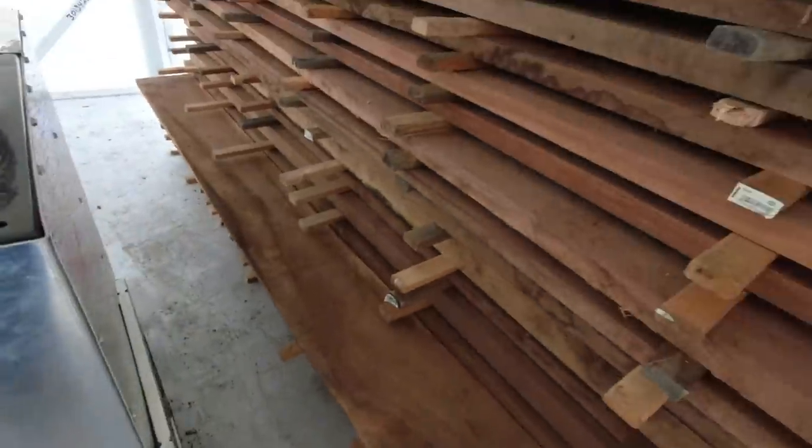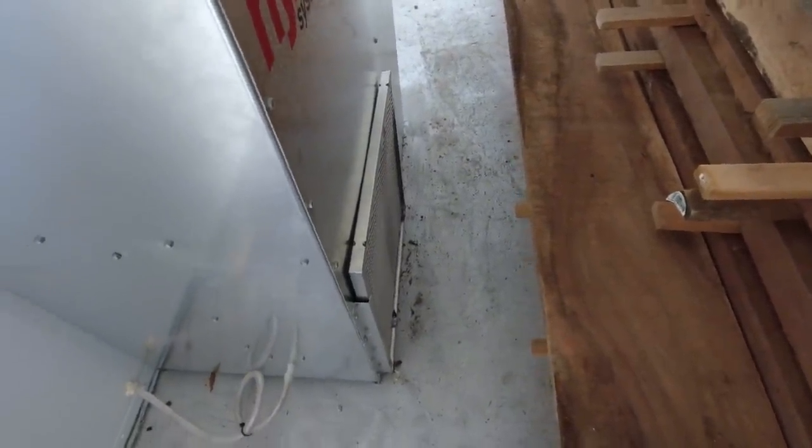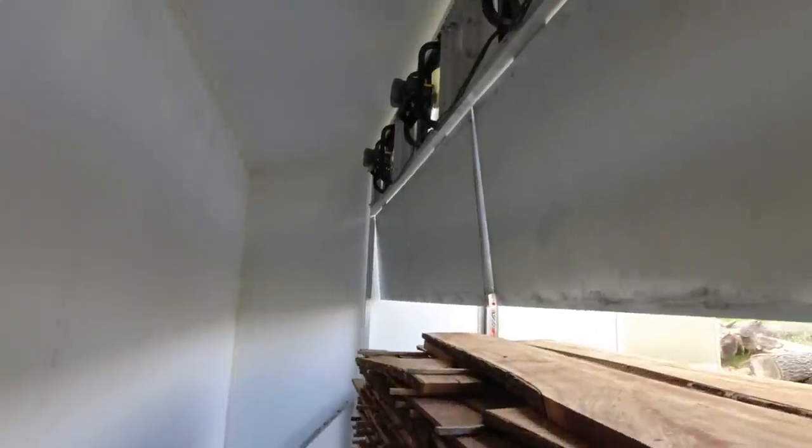It's also got its intake right there on the bottom — that's where the moist air goes in. It goes through the condenser and gets turned into water, then goes through that little hose and dumps out of the back of the kiln. All the water coming out of your wood gets sucked right in and condensed into water. Now guys, this kiln unit is not drying your wood — those fans are not drying your wood. To make it simple: all you're doing inside a kiln is creating an environment for the lumber to properly dry. You're controlling the temperature, the humidity, and the air flow.